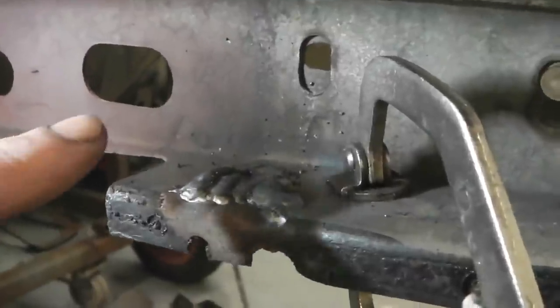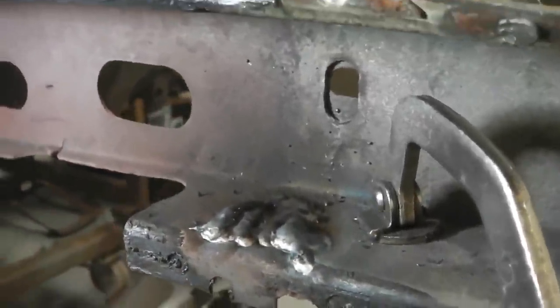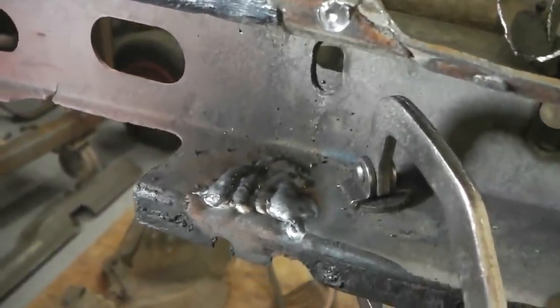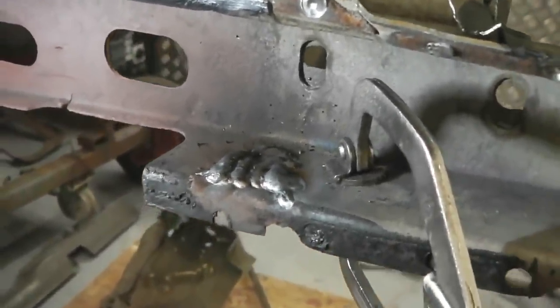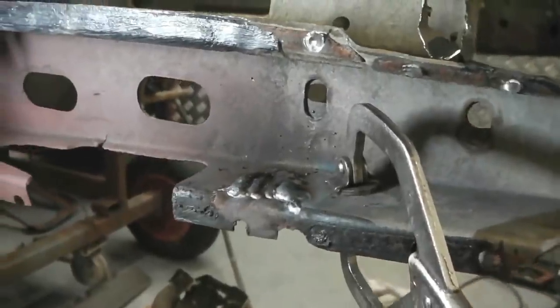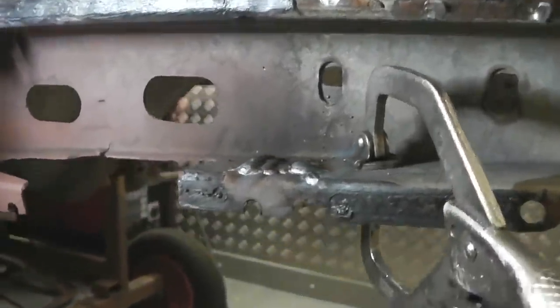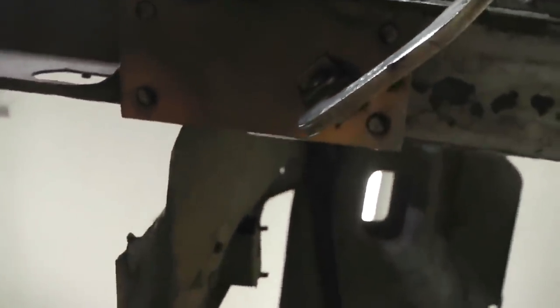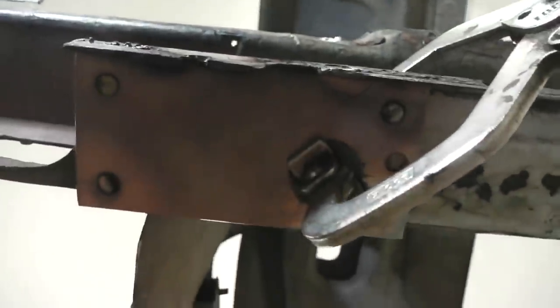Frost do it as well. If you want to get a copper pad bar, they do a mag mount one as well. So you can clamp that on from the back and then weld in at the top, and then pull your weld round. And for pinholes, it's quite good. It's quite a good technique, because the weld will not stick or fuse or weld to the copper. It just bounces off it.